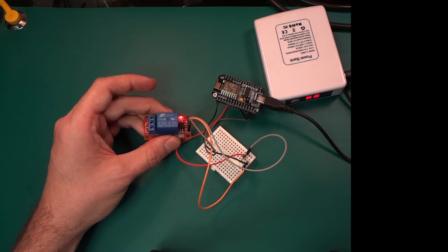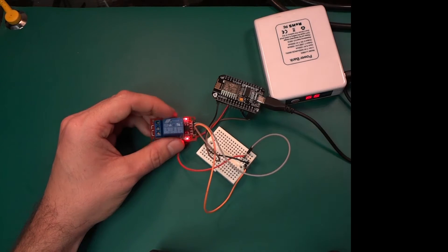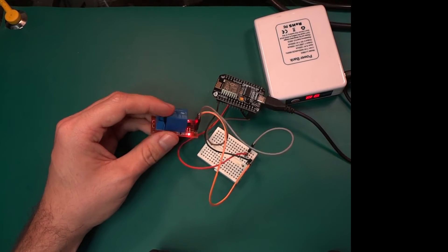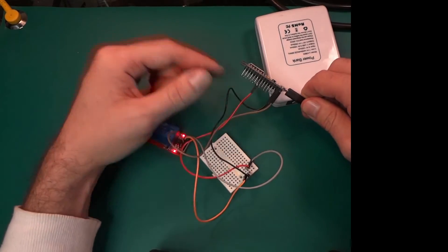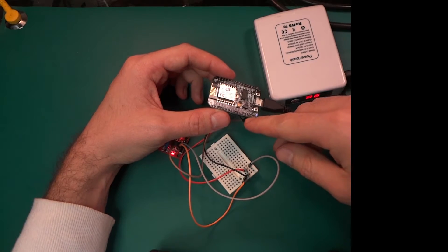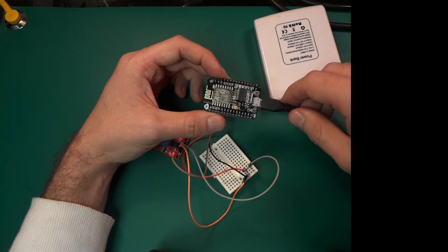But as you can hear, there is no sound of clicking. I bought this as a module for Arduino and it should operate on 5 volts. I started debugging to check if the pin is working, and I found that the NodeMCU operates on 3.3V digital high.